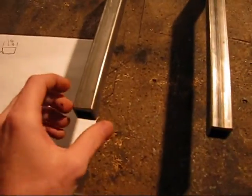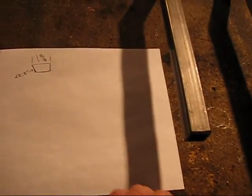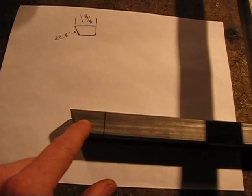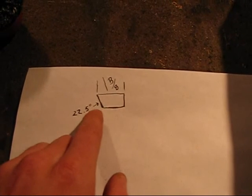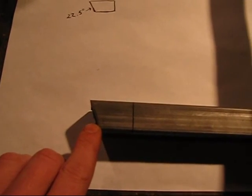What I'm going to be doing here is just a simple bolt pin through. But what I need to do first is — since this frame, the primary section of the frame, is going to be offset by an inch — I'm going to take a piece of one inch by one inch, .095, cut it, with one edge having a 22.5 degree cut.